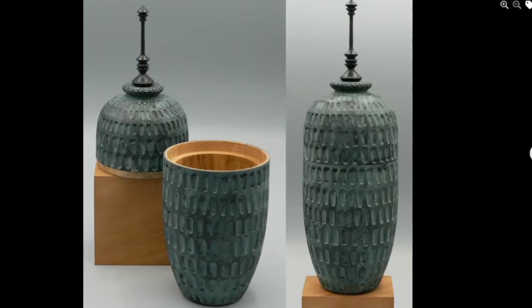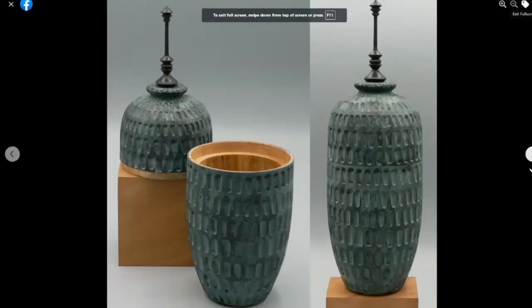What are the dimensions? It's about eight and three-quarters high by three inches in diameter. Is the finial integral to the top or a separate piece? I turned that separately and then put it into the top — I had to do that for two reasons: I couldn't have done the texturing in the top of that little button with the finial on there, and I never would have been able to paint it without ruining the finial. The 1311 — is that an aerosol can? Yes, it's Krylon matte finish.